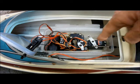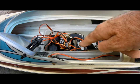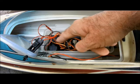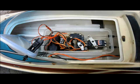What we have here is a steering servo and then a simple on-off switch operated by this servo, and then there's a giant old-fashioned 27 megahertz receiver and a 6-volt battery box which holds 4 AA batteries. Most of that's going to be coming out. Everything in fact except the steering servo.